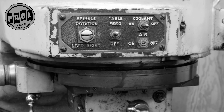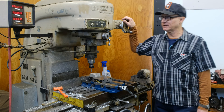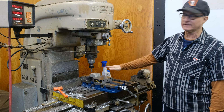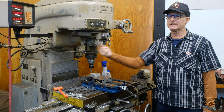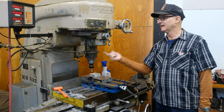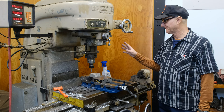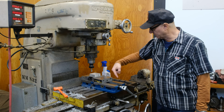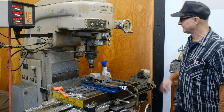If you're not into it, just move along. This is what's called a Kearney & Trecker Model 2D. It has the regular X axis, Y axis, and Z axis, but this baby has something special — it actually has a rotary table built into the head. I'm going to do some circular cuts and explain a bit about that. You can move this spindle off center, then engage the rotary and it will cut a circle, or half a circle, or you can cut at an angle.